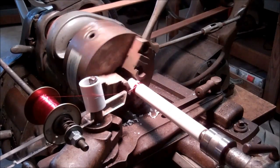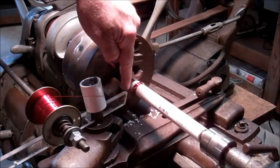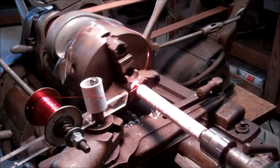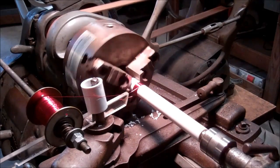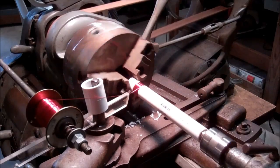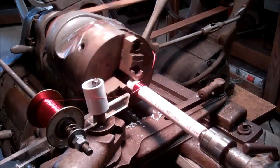This is something I've always wanted to try — winding the coil with a lathe. I've got a plastic tool bit here with a small hole in it, and the wire's on a spool here with a spring keeping tension on it. This particular wire has a diameter of 17 thousandths. I've got the lathe set in reverse for a feed rate of 17 thousandths per revolution, and so far it's working pretty good.